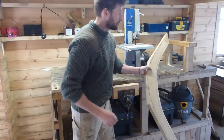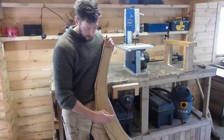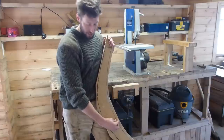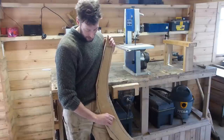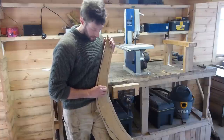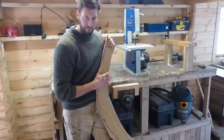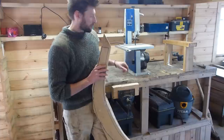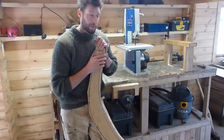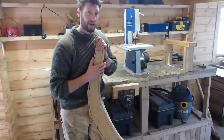First thing I want to do today is rough these frames out along these lines, drawn in marker to make them nice and obvious. The marker pen has a dimension and strictly speaking our line is just inside of that marker line - so if I cut to the line, that gives me plenty of room to allow for fairing. We're only talking about a bevel ranging up to about 4-5 degrees, which is not a great bevel. So I'm going to cut this square and fair it by hand.